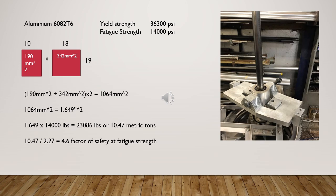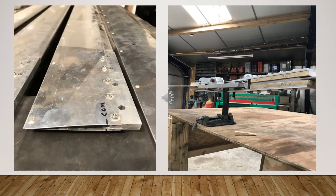My hubs are over-engineered and could be lighter, but should be very safe. Bear in mind that a hole drilled through a plate is a stress riser and strength will be compromised to some degree. You can do the same calculation on rotor blades. Where the blades are sandwiched between an upper and lower blade strap, the friction created can be much higher than the shear strength of the bolts, but bolt shear strength should be taken as the value required. Where bolts are holding two plates this is called double shear and the shear strength is doubled.